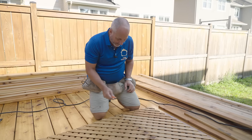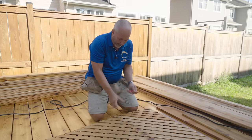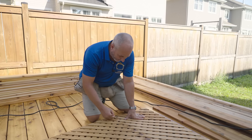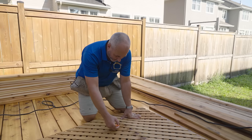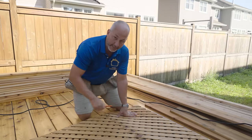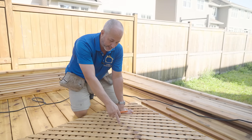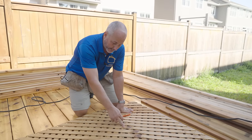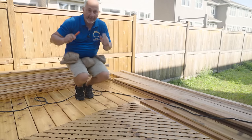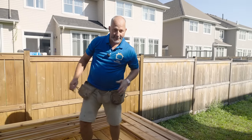So what I want to do is remember that since I'm using that bottom 2 inches of wood, I'm going to throw a chalk line on, but when I'm cutting, I'm going to be careful that every time I get close to a staple, I'm going to adjust up or down a half an inch and finish my cut away from the staples. One, it's hard on the blade, but two, that damage usually ends up resulting in tears in the wood, okay? So we're going to take a really simple approach here. I'm going to get my chalk line and throw my measurement on, and then we'll get started.